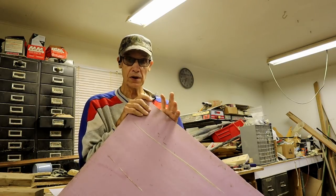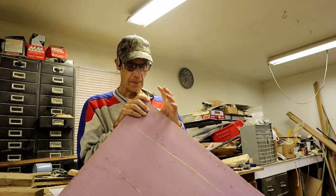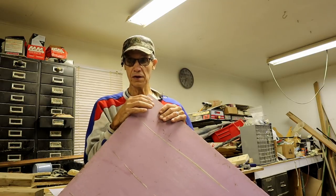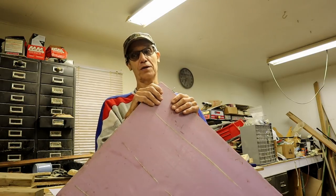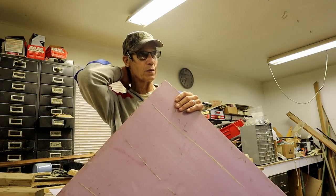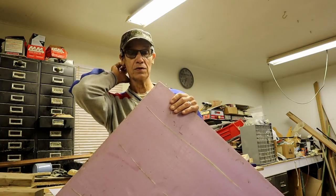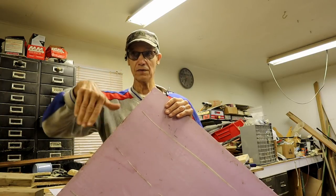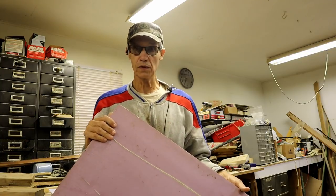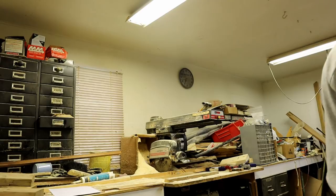And all the dimensions I'm going to give you are for 2-inch styrofoam. If you change the thickness of the styrofoam, you have to figure out your own dimensions because it changes. Because it ain't like a regular box. We're working off the inside dimensions, so that the box sits flush inside, and outside we don't care what it does, hangs over or whatever, because of the insulation. It's going to hang over because a regular box is only 3/4. But that's the main part of that.